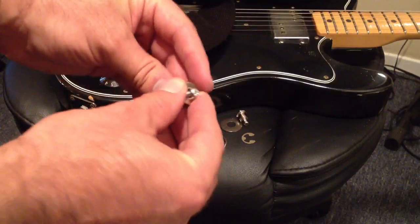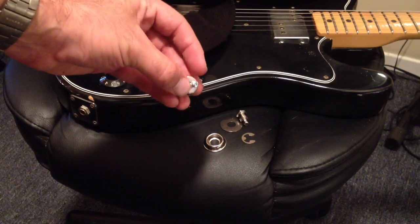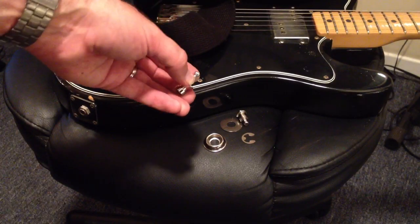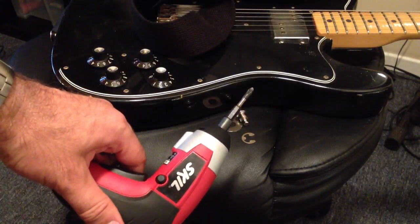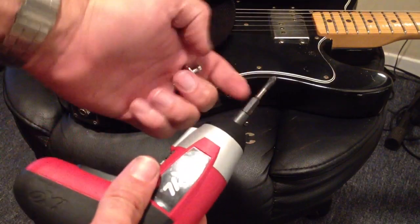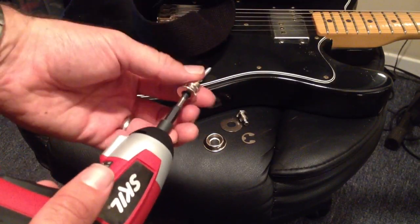The problem with these is the screw heads are very narrow. So you need a narrow number two screwdriver — though a number two is actually kind of a heavier head. There aren't many narrow ones except for this brand, which is a bit that I use in this little electric screwdriver. Milwaukee brand bits are thin enough to fit inside those heads.